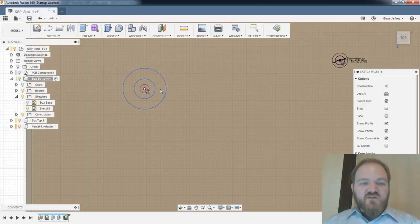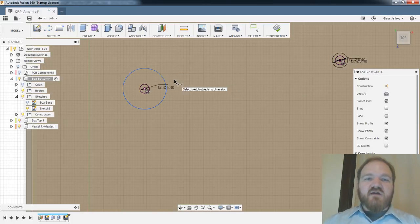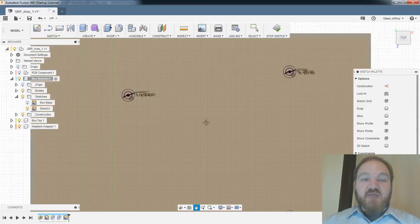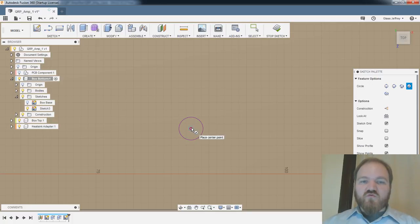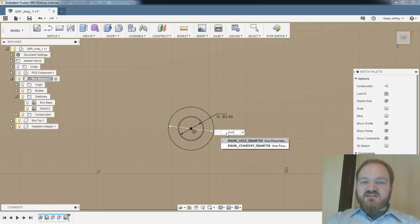So what I was starting to say is I am really interested to see how well this thing handles it if I go back and I take my hole in my PCB in Eagle and I move it a millimeter or 10 millimeters or 100 millimeters. How well is that hole referenced in Fusion? And is all this geometry, which should be concentric with this projected circle, going to follow? If this was a Fusion component, when I moved the position of that hole on a native Fusion component, it would update the position of the center and everything would track with it. I really hope that happens, because if it doesn't, then this whole idea of sucking the PCB into Fusion is not super useful.